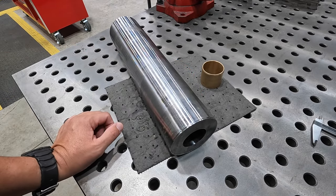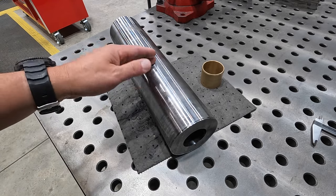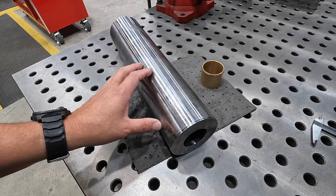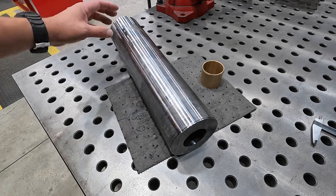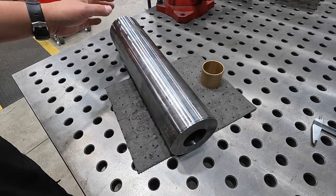His small lathe over there - he's got a nice lathe, a little Sharp - but it did not come with a steady rest. We're going to see if we can find him a steady rest for the machine. That's the problem: he's only got the chuck, and this is way too much stick out for that small lathe of his. I believe it's like a 14 inch swing.